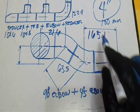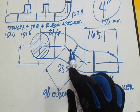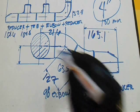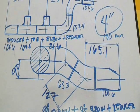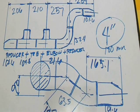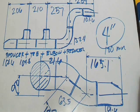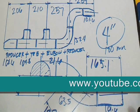Adding two 45-degree elbows: 63.5 + 63.5 = 127 mm. This is very easy and very important — just take note of all these takeoff values. All of this is in a 5-foot section. Thanks for watching guys, I hope you have learned about piping takeoffs. See you next time, bye.